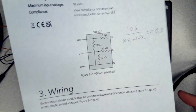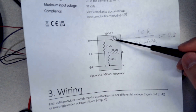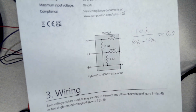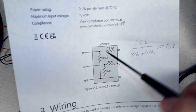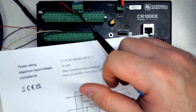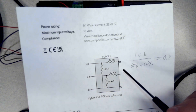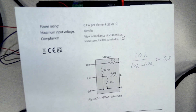A very important piece is you need the wiring diagram. In the sensor manual you will find a wiring diagram that will indicate several resistors — there's going to be at least two. If your sensor only has one, the other ones you're going to add are either internal to the datalogger or with an input module. Fixed value resistors will have a number with them and might be labeled RF for fixed. The one that changes resistance in a sensor will be labeled RS for sensing, or you might have a different symbol.